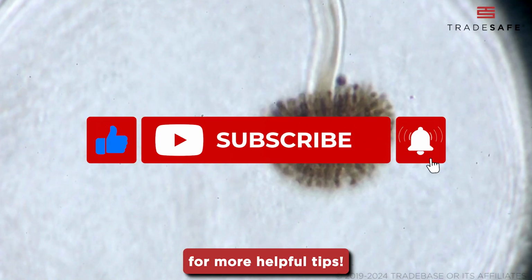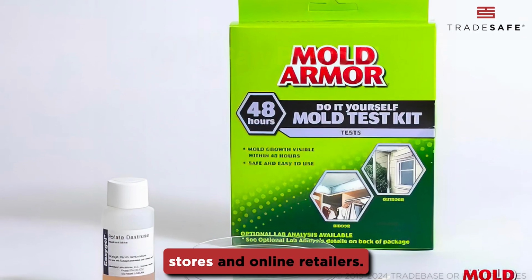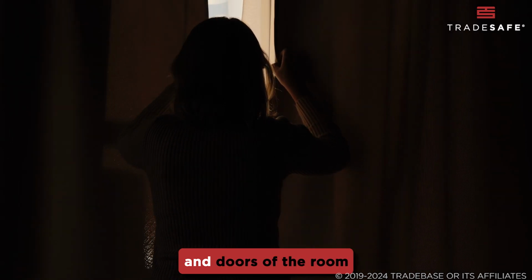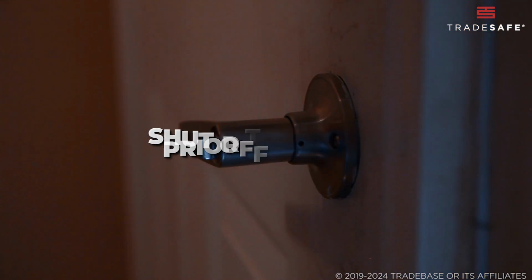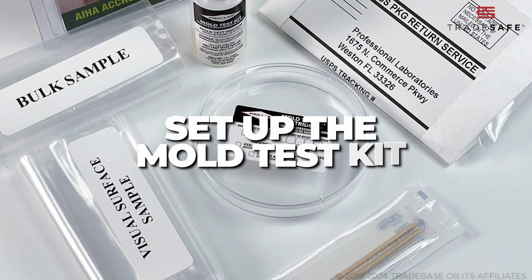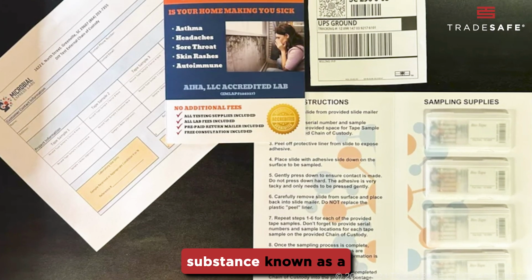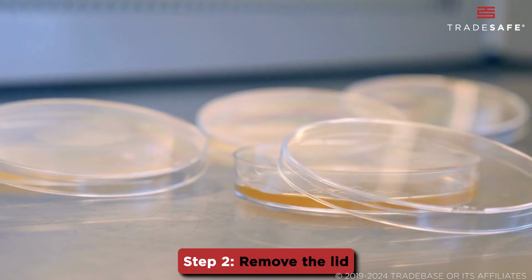DIY mold test kits are widely available from home improvement stores and online retailers. Before you use this, make sure the windows and doors of the room you'll be testing are shut 24 hours prior to testing. The first step is to set up the mold test kit. It should include a Petri dish with a lid and treated with a substance known as a microbial culture to promote mold growth.